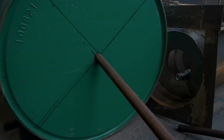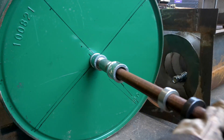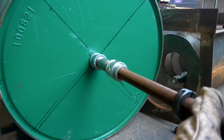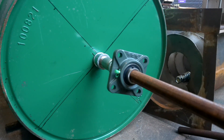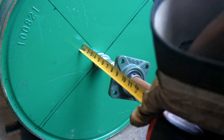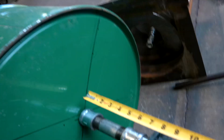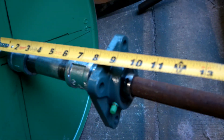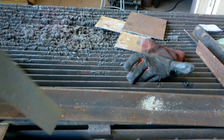So let's get started. We have the shaft here, and I put these fittings over this shaft. These fittings are gonna represent how I'm gonna seal this shaft - they're gonna be like where the packing and stuff will go. They're gonna go before the bearing, because I can't really seal the bearing but I can seal the shaft. So I want to make sure I have enough space between the bearing and these couplings in order to make a seal.